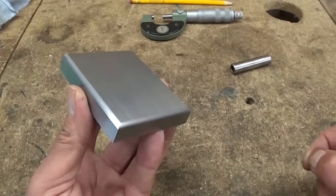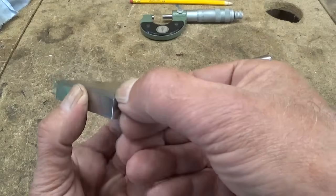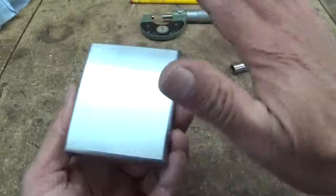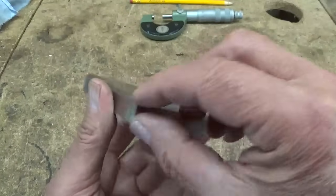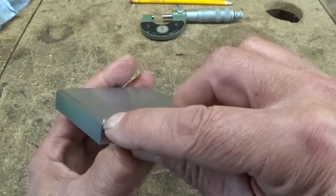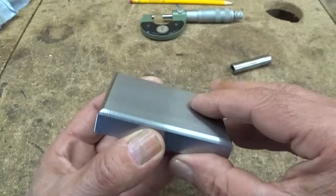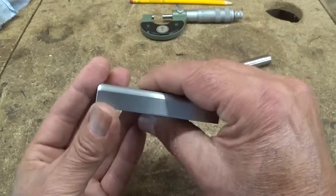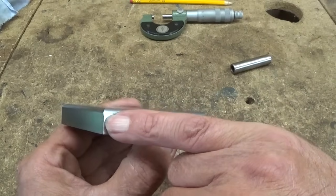And this is the result. These little lines here in the corners, they are in the corners. Now, this thing I just wiped off with a rag. I didn't even deburr, nothing at all. I didn't touch it. And this line also very good. There's a tiny bit of chatter marks here, but almost nothing. The only corner that failed a bit is this one.